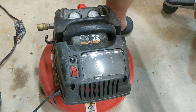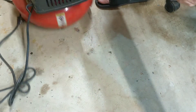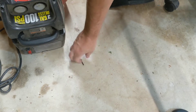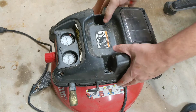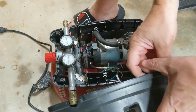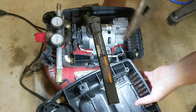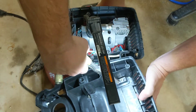The first thing I'm doing is just taking the cover off so I can get access to the switch wiring. Basically what I'll be doing is taking that switch and making it remote. You can see the way it's wired: the hot wire goes through a fuse, then from the fuse to one side of the switch, and from the switch back over to the motor controller.